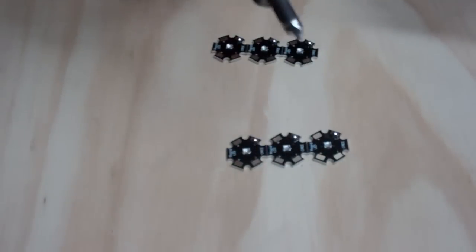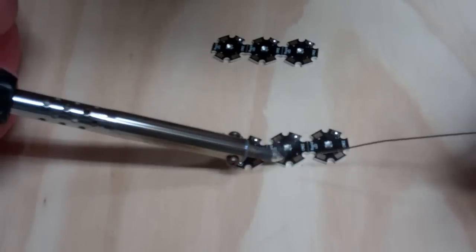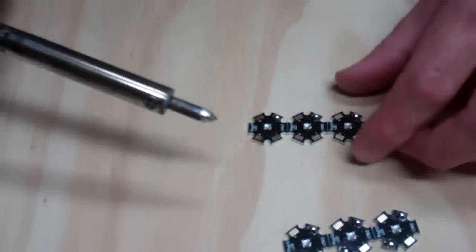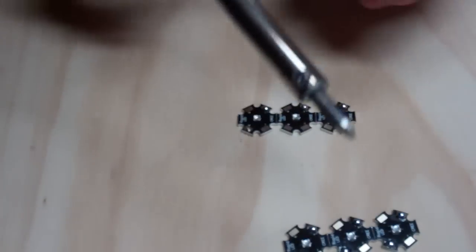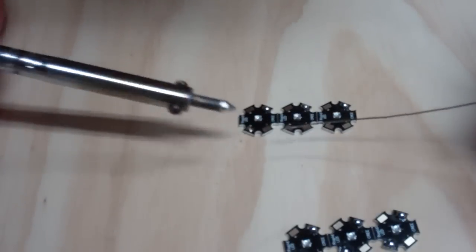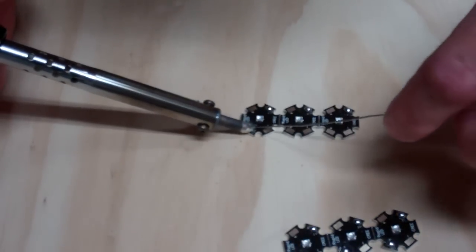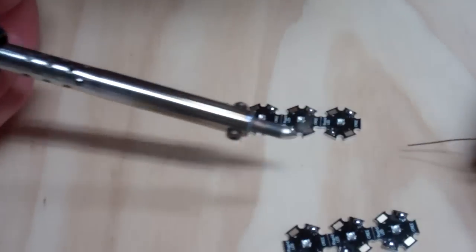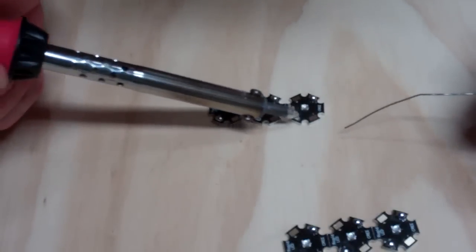What I like to do for the wire connection is rub the wire onto the soldering iron tip and just heat it up a little bit — what it'll do is the solder will wick right onto the wire. Notice you want to do this fast. I've got enough solder built up on the iron where if I touch the pad like this, it sticks. What it should do is spread. My soldering iron has cooled down a little bit here, so let's try this again. If you get enough solder on there, there you go — I put the solder on the tip first and then tapped it on the pad.